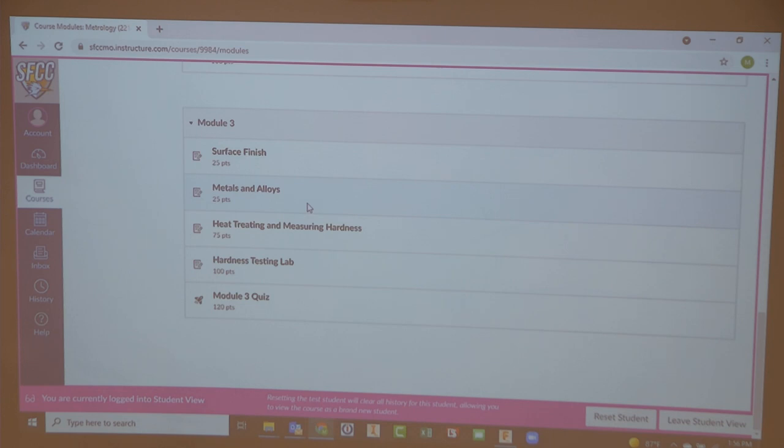Okay, so I'm going to lay it down. When I Rockwell it, which way do I want to Rockwell it? This way, or does it matter? Probably the fastest way to save material to test through. Typically I want to go with my largest surface area, the area that's biggest mass. If this had big chunks cut out of it or a corner, I would adjust how I did it. I see what you're saying though, as far as you get density this direction. So I'm going to set it down and make sure that's good and clean. If I have tested it before, I want to make sure I don't go back into that same little divot.